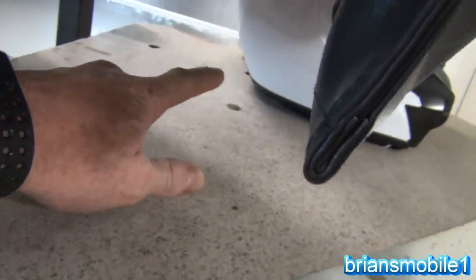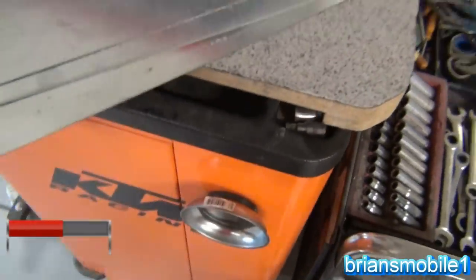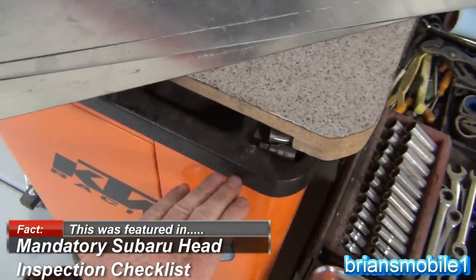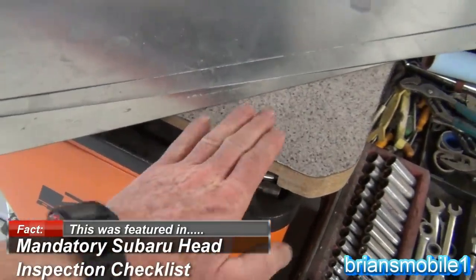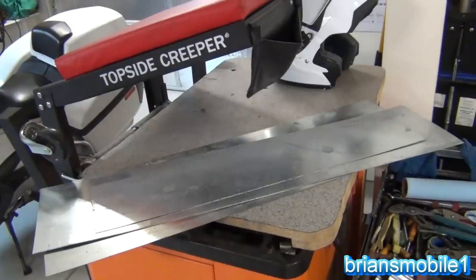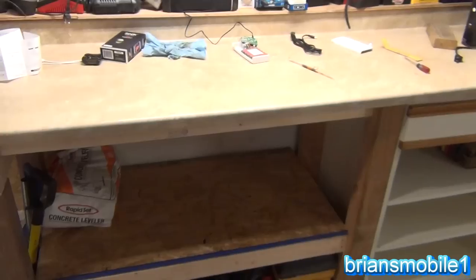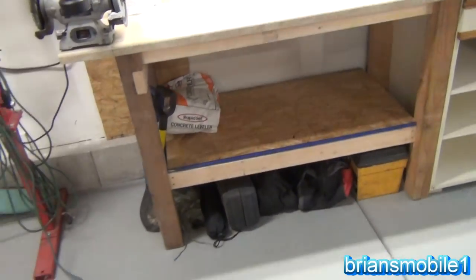You see the holes — one, two, three — is it belt buckle height? No, it's a little too high. It's about a belt buckle height right here, and then plus a little, and this was just a little too high. You find you're working with your elbows on the workbench all the time, having to reach up to get to stuff. That's my workbench and I'm sticking to it.